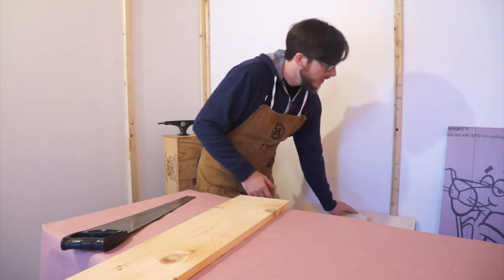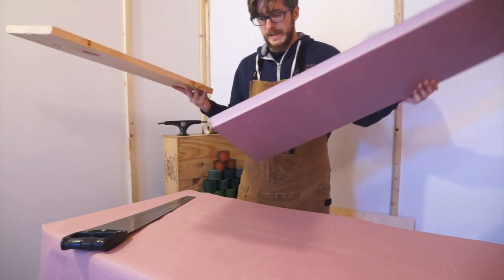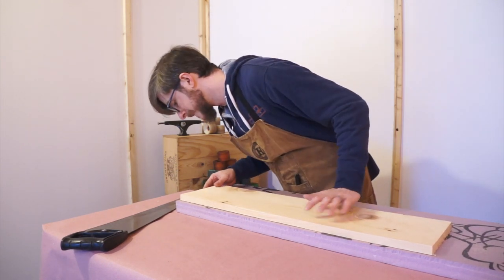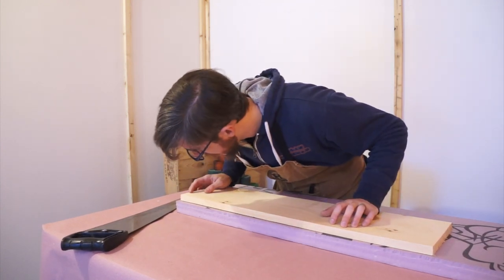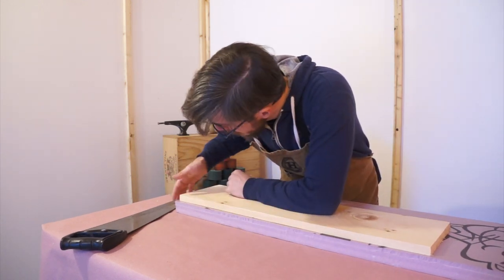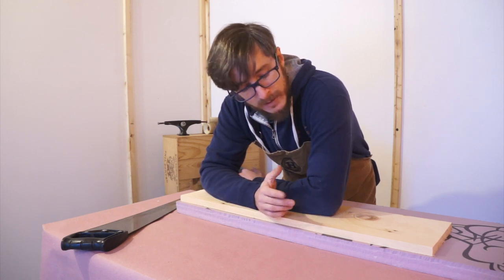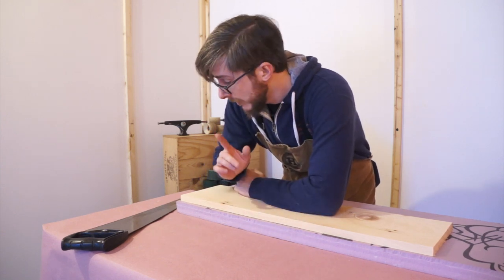The next thing we need to do is cut a block of foam to shape. Instead of using a ruler, we can use the backing board as our measuring tool. Looking at this particular chunk of foam, I'm actually going to cut all four sides because the ones that came off the machine are really not flat — there's dips and curves in them. You can use it as-is; it's not going to hurt your mold too much, but it makes layout of all your board shapes easier if you have nice straight sides.